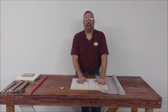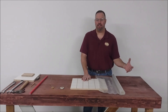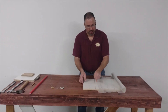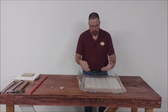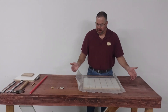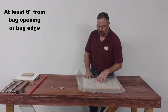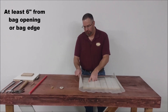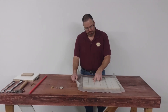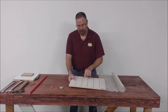It just makes your life easier. So if you have a 4x8 baseboard in there but you're going to be pressing a small two foot by two foot piece, you don't have to slide your piece all the way to the end of the bag. So I like to slide my baseboard into the bag and then choose where the best spot would be. We usually recommend at least 6 inches from an opening or an edge. So I like to cut the bag in half and choose the centermost port. This connector port might be a little close to the front end of the bag, so I'm just going to go here — this is where I'm going to put my connector. Just remember it's the second one dead center, second groove up.